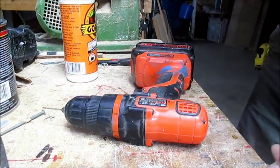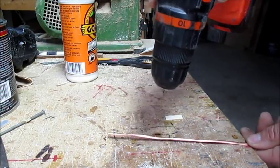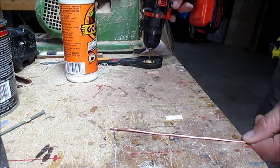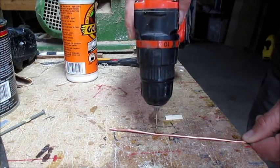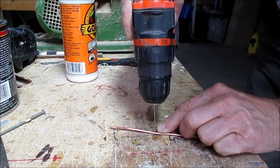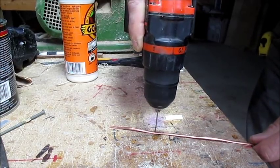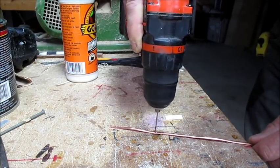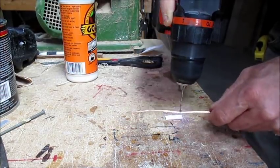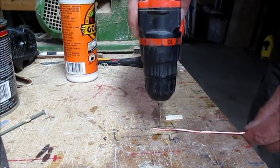Okay, now this is a small hole. The drill bit is very fragile. Okay, make sure you can see this. And you definitely have to put cutting oil on; I have cutting oil in a beer cap. Find that little indent that you put, and you want to go slow, and it will go right through. No problem. The key is to go slow, not force it too much.